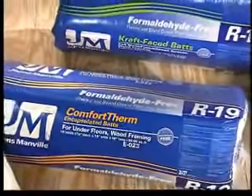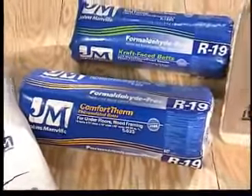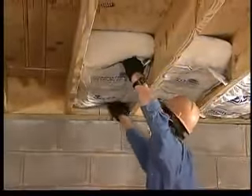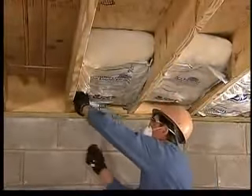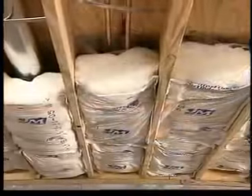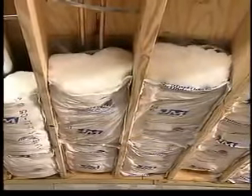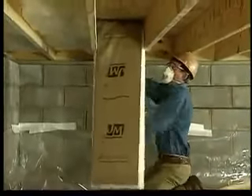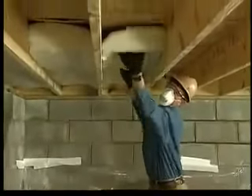You will use either Comfort Therm underfloor insulation or kraft face insulation. Insulation not only encloses the interior area in a thermally protective sheath, but also helps prevent moisture movement. It is important to note that with kraft face insulation, the facing is generally against the subfloor.